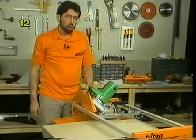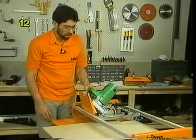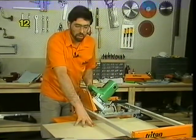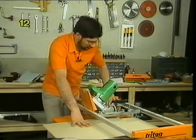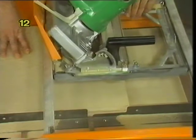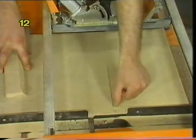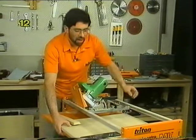A bevel cut will put an enormous amount of load on the power saw itself. The saw's got enough to cope with without you twisting the hand grip during the cut. So switch off the power, lock the trigger of the saw on, make sure everything's nice and tight — the saw is fully clamped down, wing nuts everything tight. Then you can do the cut holding the wood quite firmly, as there is a tendency for the wood to move sideways. If you didn't move that sacrificial board, you'll now have a score line made by the tips of the blade teeth — clamp that board in position and the saw blade will always pass through that line, giving you an excellent sighting point for future cuts.